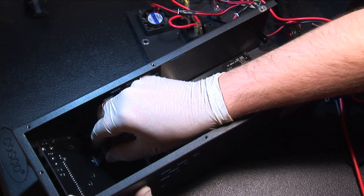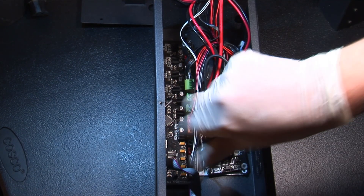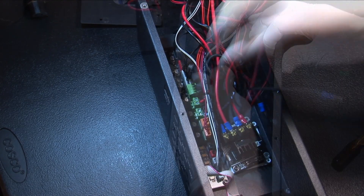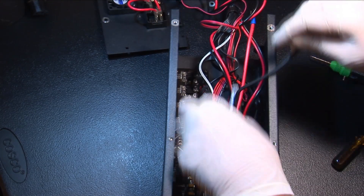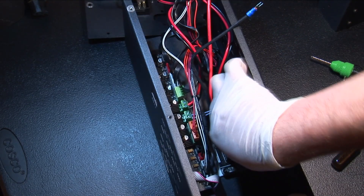Make sure that you plug the LCD screen back in as well. The screws to mount the MOSFET board aren't usually included, but you can pick them up at your local hardware store — they're just simple M3 hex screws. Once both boards have been mounted, plug in the blue and white wire to the MOSFET board connector.